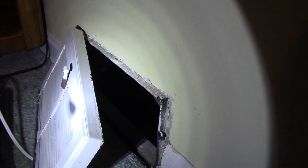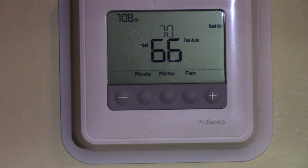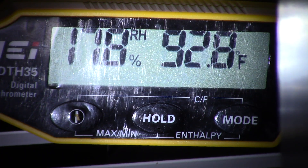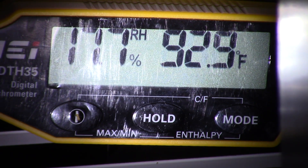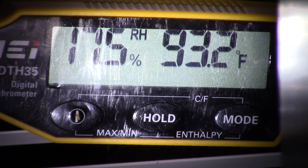That's why he does not like the booster fan. So we just started, and I'm going to set up the thermometer on that vent. It's been running for almost 10 minutes now, and you can see the temperature of the air coming out of the vent — we're almost at 93 degrees, around 32 Celsius. The room has already come up to 67 degrees, and I expect that number will keep going up. It's probably around 50 degrees outside, around 10 Celsius. We're going to let it run some more and see how high we can get that temperature.